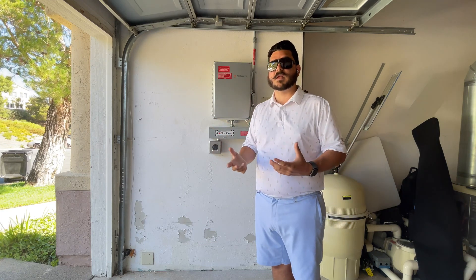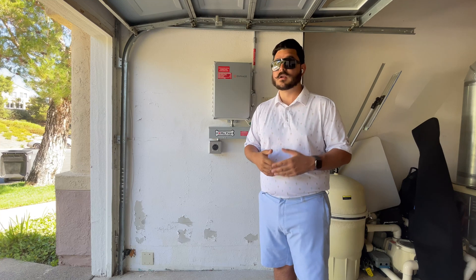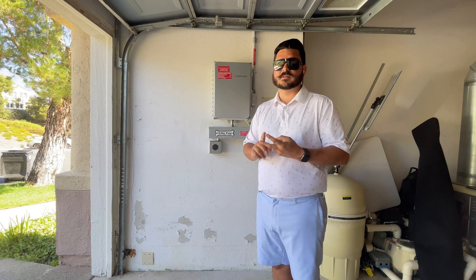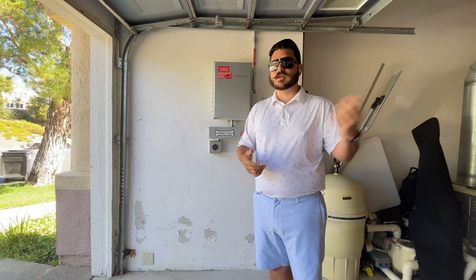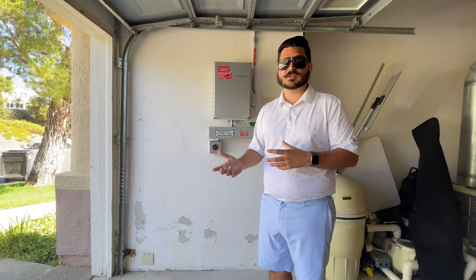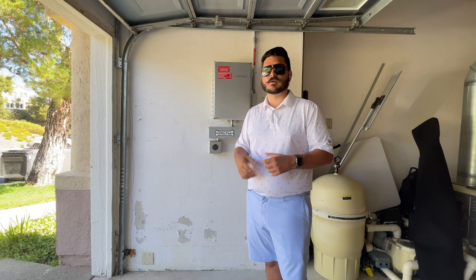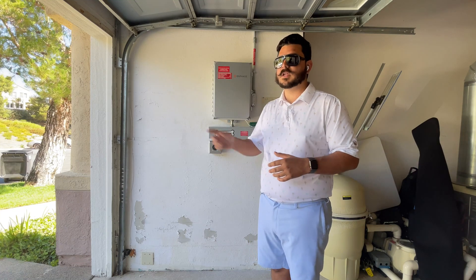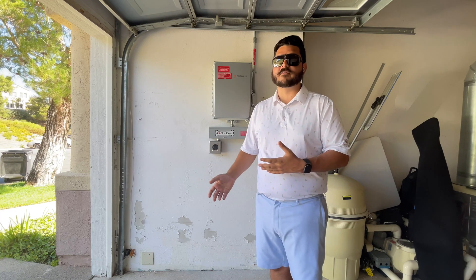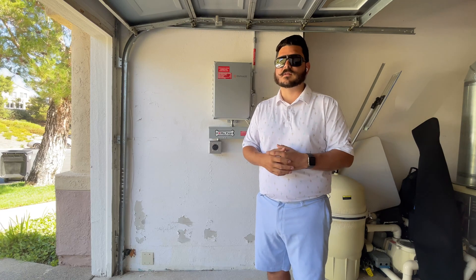Some manufacturers still don't even offer Wi-Fi built into the unit — SolarEdge being one of them. Their focus is hardwired or cellular, but many installers don't run that line. What we tend to do is hardwired with a range extender so you still have control to change your network without any potential issues. Newer SMA Sunny Boy units do have Wi-Fi, but older systems like Fronius, ABB, and older SMA units didn't have that type of monitoring — the screen was your monitoring.